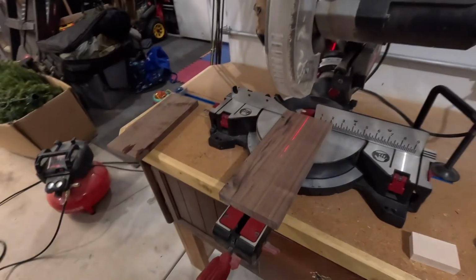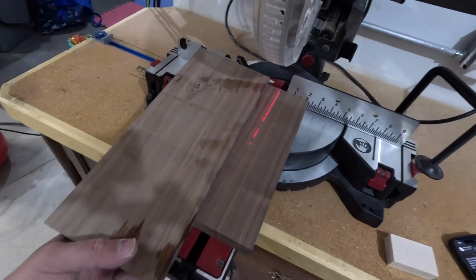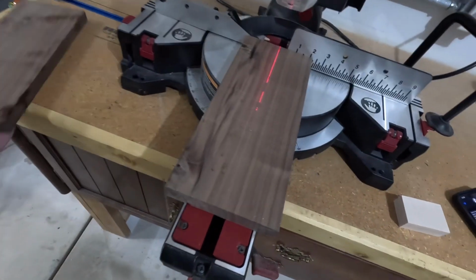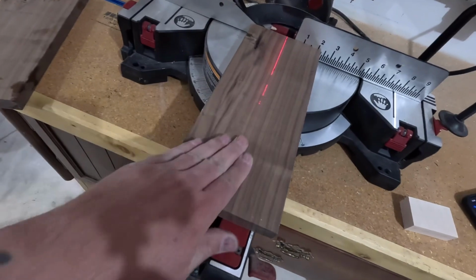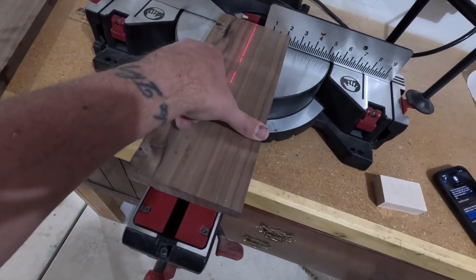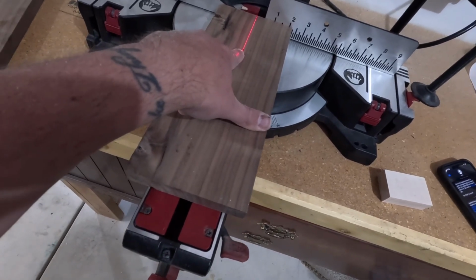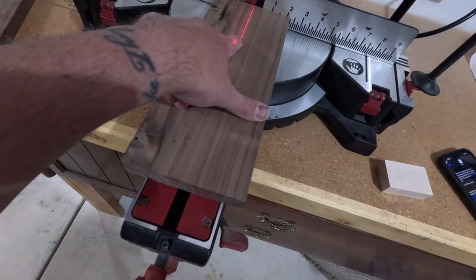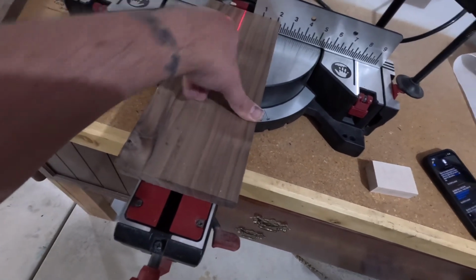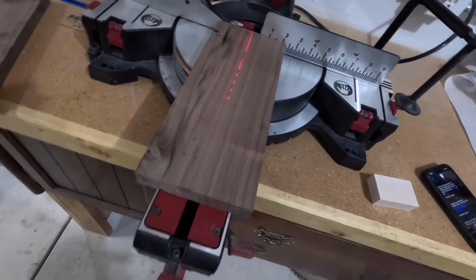We keep moving with this coin holder. Kind of looking at these two pieces of wood. This one's going to be my base. And then this one's going to be the two other elevated coin racks. This piece here is 4 7/8. So I have it marked at 2 3/8. And then I will cut to the side of that so that each piece is 2 3/8 and use 1/8 inch of the blade to cut down the middle of those.